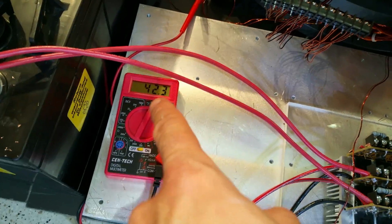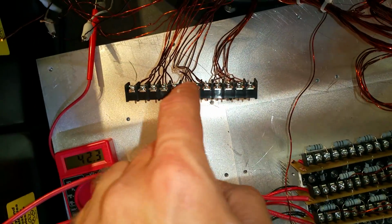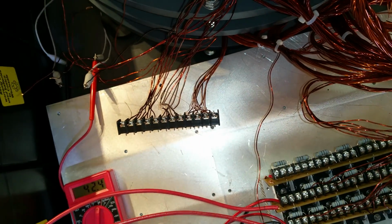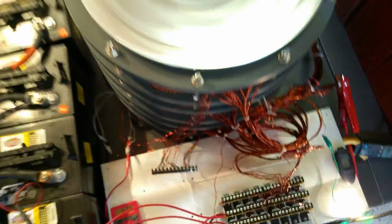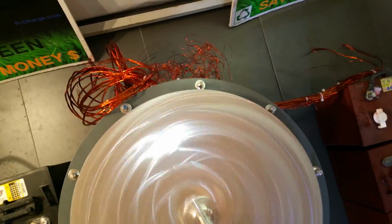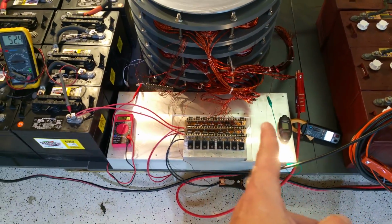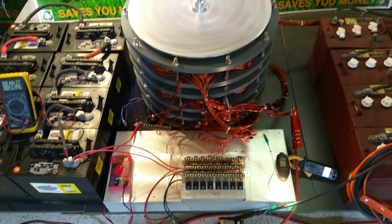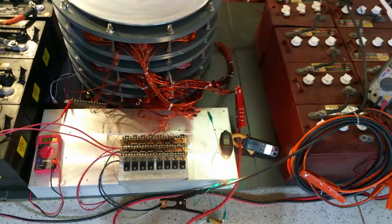This is just at low RPM, so it's low voltage, it's the AC, and then we have them all in series here. So we have this side hooked up just every 5 coils in series, and then on the back we haven't hooked anything up yet. It's just a big mess of wires yet. So what we'll have here is half of the boards on this big heatsink, 15 boards here and 15 on the back. And we want to check to see that the temperatures are all good.